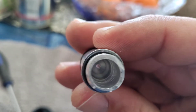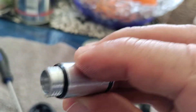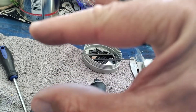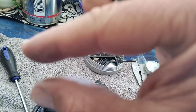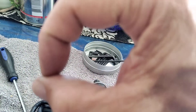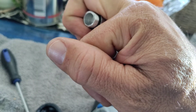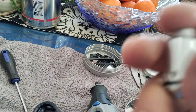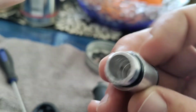I was able to take about eight thousandths off of inside of there. What I'm doing is — there's more material taken out back here — and it's basically going to form like a blow pipe. You're starting with a big opening and then narrowing down to a very tiny opening, which creates a ton of velocity, which in turn is going to give you more feet per second.